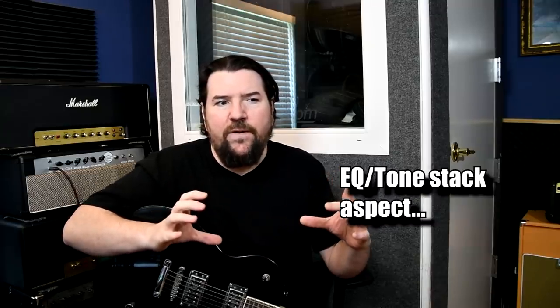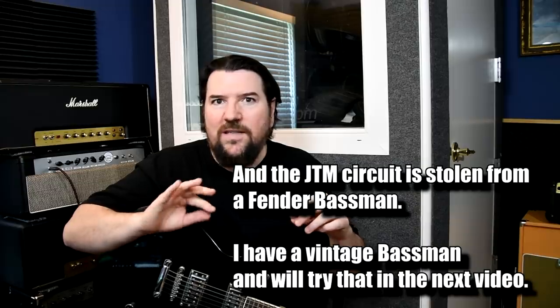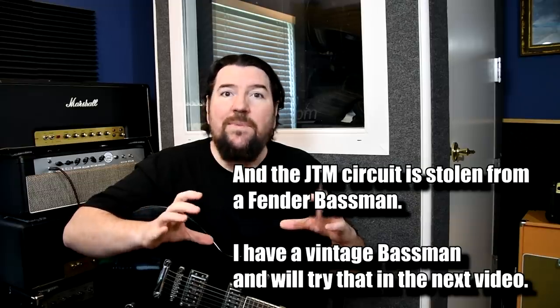So the super bass, he's using a super bass Marshall, but it's really similar to my '69 Plexi. I believe it's practically a JTM45 circuit, but with a couple of values changed out. I might be wrong, but I do believe it's very, very subtly different from the guitar amp. And I think those little values are where I'm off. I tried everything to get my '69 Plexi, yeah, I know it looks new, but it has vintage internals, to sound like that album. I couldn't do it. And I believe it's because of these little resistors and the different capacitor as well. But they're not huge.